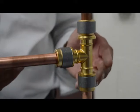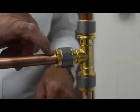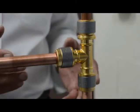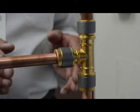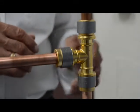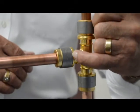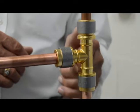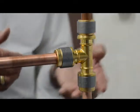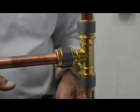The inspection is fast and simple. We're looking for the depth marking line, and we can see that it's visible on the tubing. This assures that the tubing was properly installed, and that the collar and retainer were moved forward, making the proper swage. The other inspection is making sure that the collar touches the body without a gap all the way around the fitting — and we can see that this is perfectly equal all the way around, so a perfectly swaged fitting.